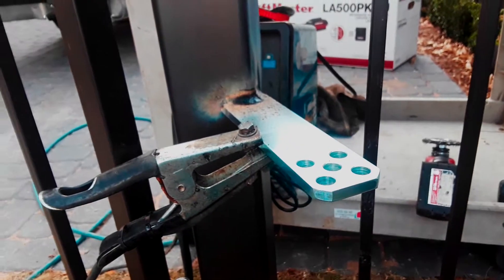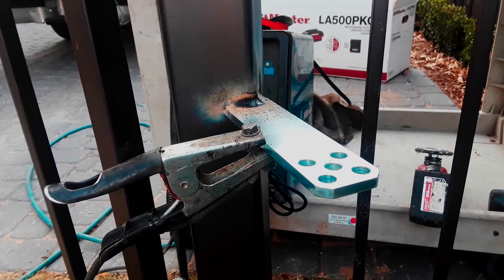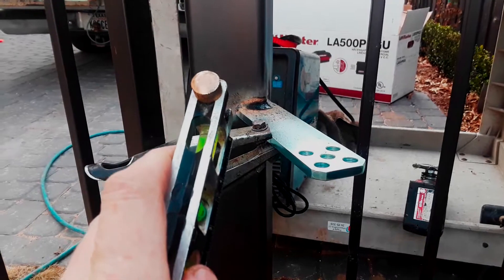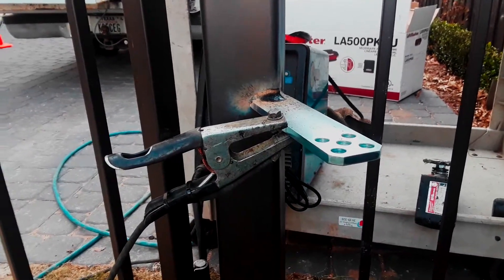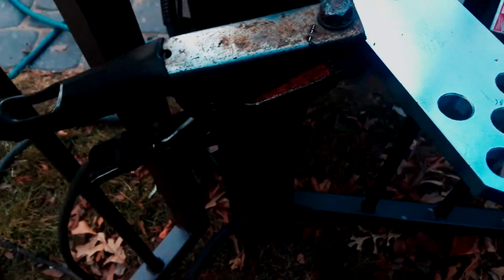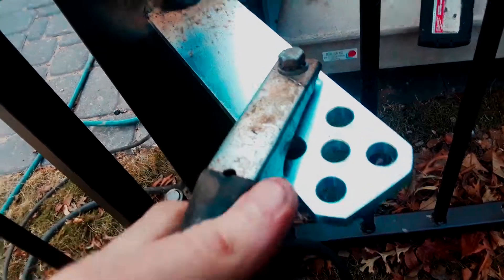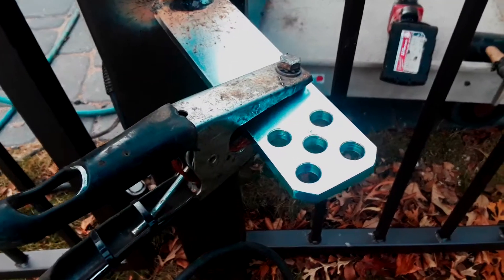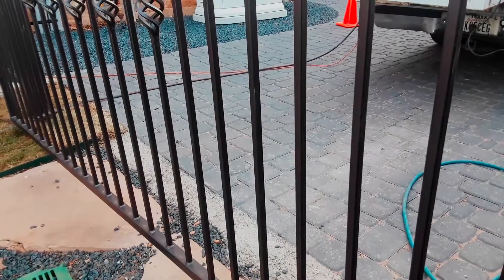If you've seen one of these before from the manual, you could tell that I've had to modify it. Unfortunately, the manual does not call for provision on a four-inch post, which is probably the most common thing we see. So I had to angle it and cut it, and I'm just going to leave it like that for now in case I've got to cut it off, and then I'll weld the support underneath it when the time comes.